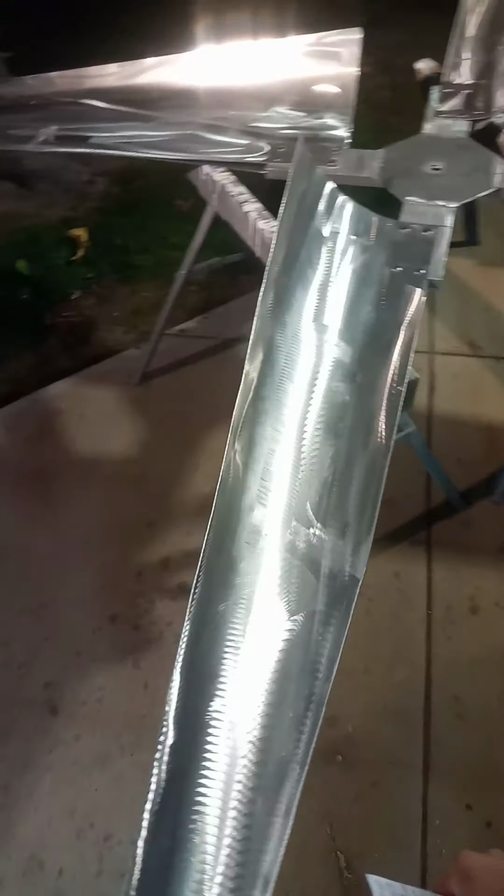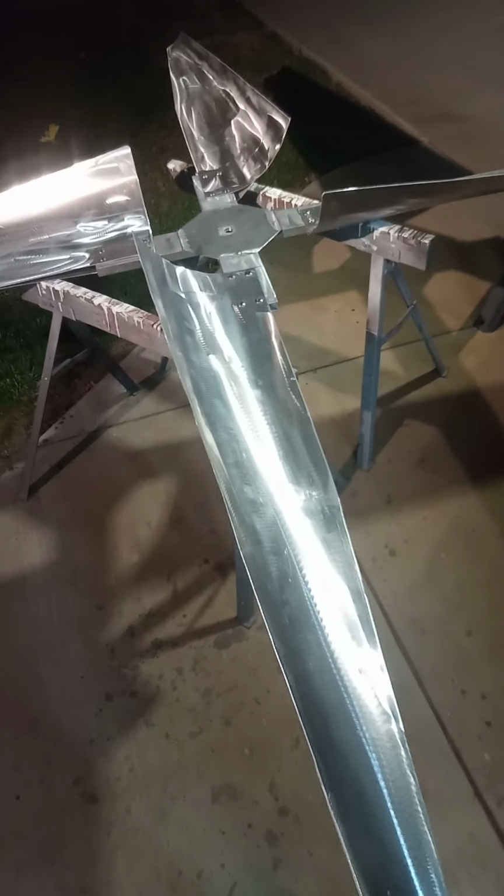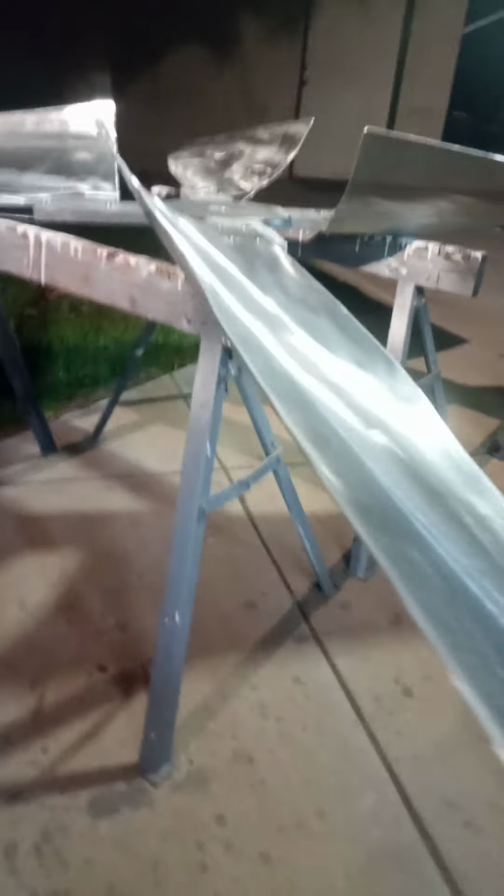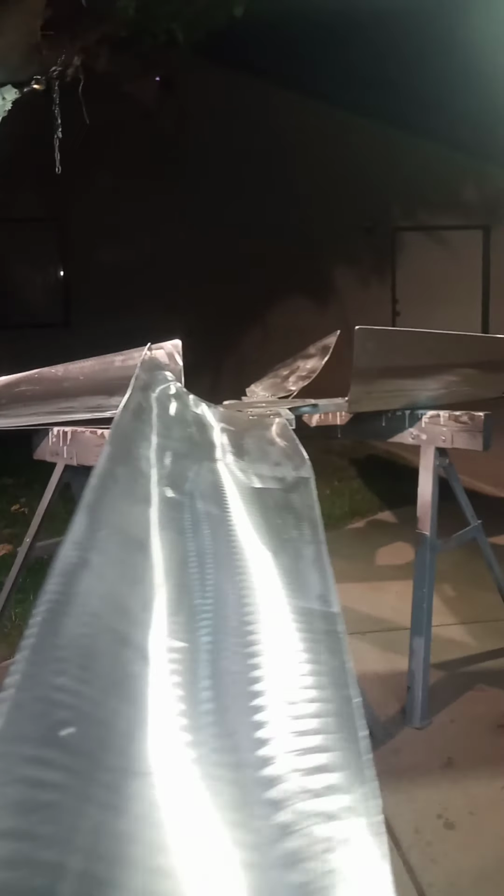So, and while I'm taking a video, this isn't for that wind turbine, but it's for a bigger one. It's my first and only all aluminum rotor, and instead of 3 blades I went with 4. And this blade shape and size I've used, but in fiberglass before, and they've worked real good. And you can see it's got quite a curve on it, so it definitely scoops the wind, and it starts moving in just about any breeze at all.